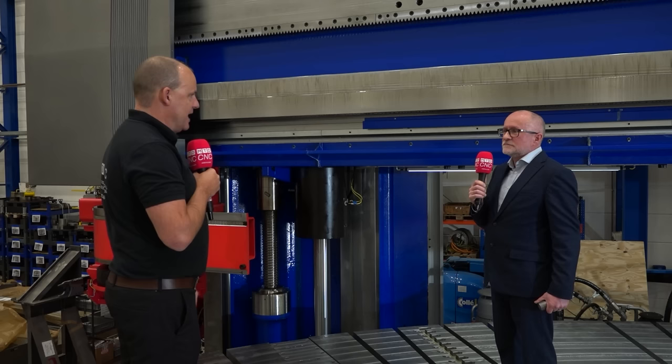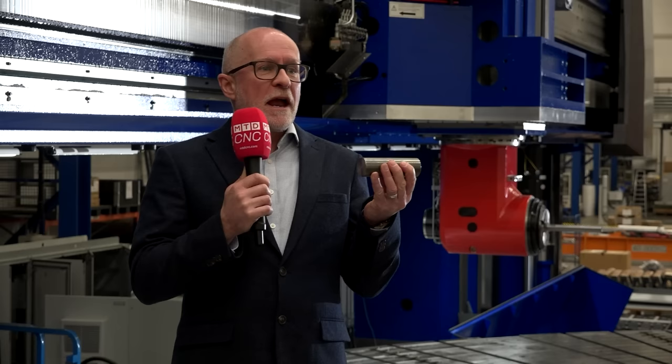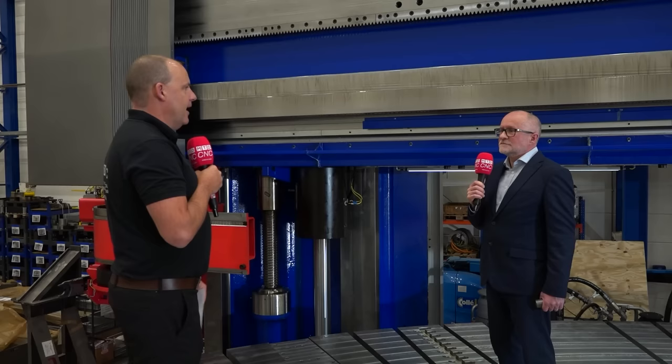You imagine a thousand tonnes — it's got to be a suitable foundation. This particular table is hydrostatic, so it's a series of oil-filled pockets in a pressurised system. This is, if you like, a needle out of a bearing. On a bearing-type table of this size, there'd be 250 of these in a cage, just to give an idea of scale. So everything's massive, but everything's proportional.